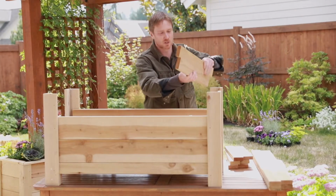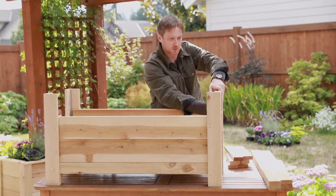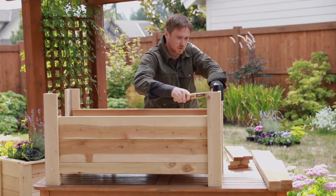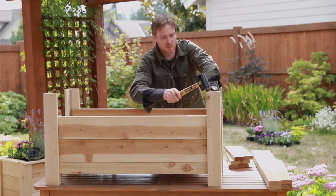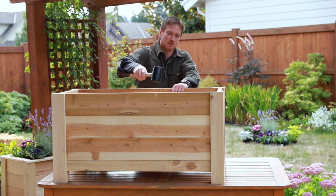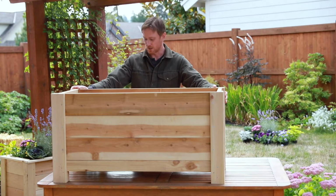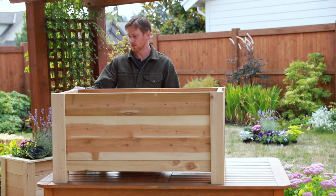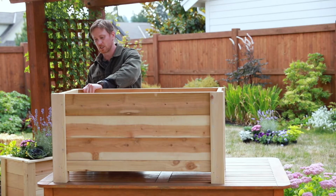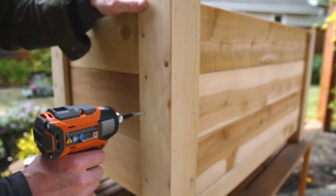So when you're putting these sideboards on, you can kind of bend these pins out to try to get them lined up. And then you'll find that when you're putting this down, it can be a little bit tight. That's where it's really helpful to use the mallet to kind of knock lock these in. So once you've got all your sideboards installed, definitely knock them down as much as possible to get them all settled and make sure there's no cracks. And then you're going to install 2 screws, 1 in each corner for each one of the boards. And when you do that, it's helpful to grab the sideboard and pull it together, make sure it's nice and tight, and get that in there.